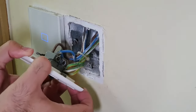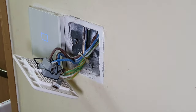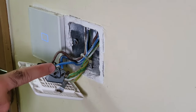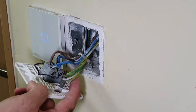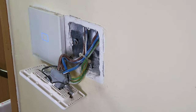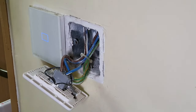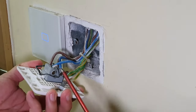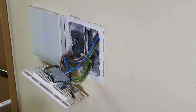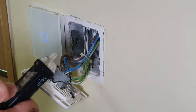Let's see what's going on inside. You can see this is not like a normal light switch — a normal light switch would just have the brown wires, a live going in and a load coming out. Here you have a whole bunch of wires: you have the brown which is the live, the blue which is the neutral, and of course you have the green which is your ground. Grab your test pen and test every connection to see whether the LED in the handle lights up. Over here I have a contactless voltage detector — I know not all of you have one of these, but if you can, they only cost about 15 bucks a piece, so go and grab one. Makes life a lot easier.